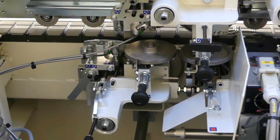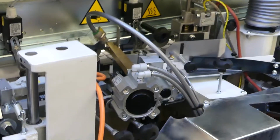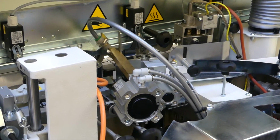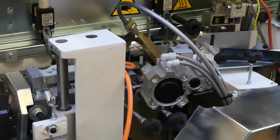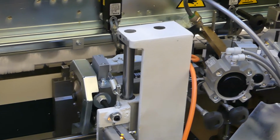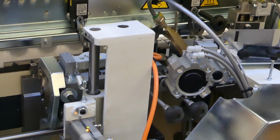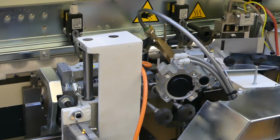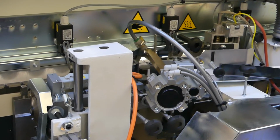I like that you've got a couple of safety things on here to make sure things haven't been adjusted. Yeah, the paint and stuff. Especially stuff with the pneumatics, they don't want to be adjusted, especially on this unit here, because it's doing all the sides. It's well tuned in, obviously the pressures and the vents. You can have a lot of issues if people start adjusting those. People do though, eh? You find that when people think they know how to adjust things, they get itchy fingers.